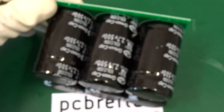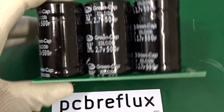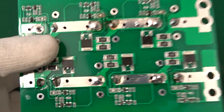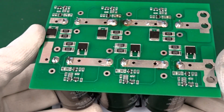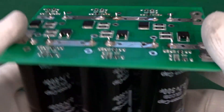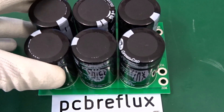And I definitely want to do something with this 2.7 volt 500 farad supercapacitor bank with 6 supercapacitors, and also some charging protection. We have already soldered some LEDs to this board so we can see when one of the supercapacitors is fully charged.